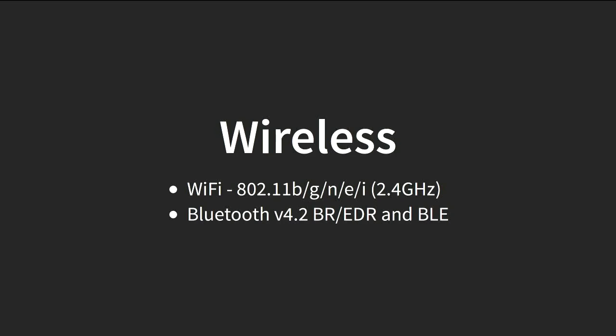The chip still has Wi-Fi built in — 802.11 b/g/n as the ESP8266 had — plus 802.11e, which is a real-time media streaming extension. The Wi-Fi also now supports HT40, so you can push more throughput over the network. The really big improvement in wireless is that there's also a Bluetooth stack: Bluetooth 4.2 with classic Bluetooth and Bluetooth Low Energy. At the moment I think there's only software support for BLE, but classic Bluetooth support — including audio and networking profiles — is coming.